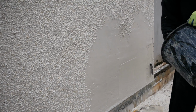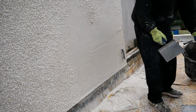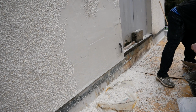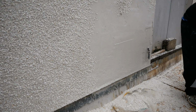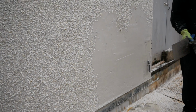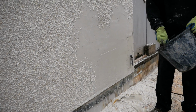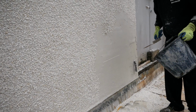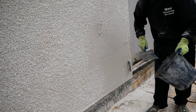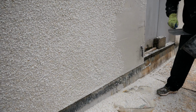As you see, I would say a good 75% of the stones actually stay on, but the other 20-25% do fall off and hit the ground. But it's not a big deal when you have bags down. You're actually saving a good lot of them. You can scrape all the stones up and wash them again, guys, as well. I tend not to do that, as the sand cement, if it's mixed with them, it'll take a lot of washing to make sure you get them good and clean. But it is doable. If you have another repatch job you're going to do, it's very, very doable.